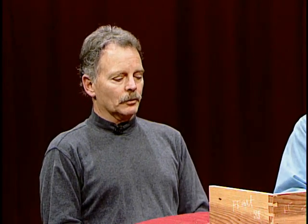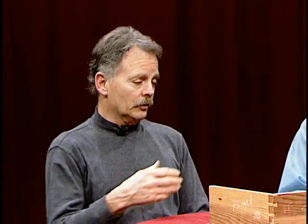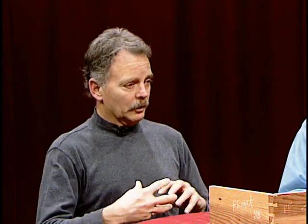How do you address that? It's absolutely, because it's gotten such a bad reputation. When people hear veneer, they think cheap plywood. It just has gotten a bad reputation. But I do a lot of veneer work in my work, and if done properly, it's far better in a lot of applications than solid wood because of the inherent stability it gives a part. Solid wood is constantly moving with seasonal changes and all that. That's a big topic of joinery, is that you have to allow for wood to expand and contract and move because it's still alive in a lot of ways.